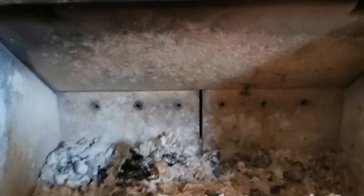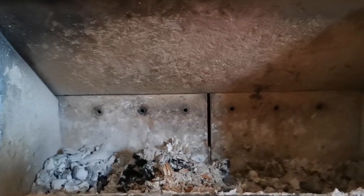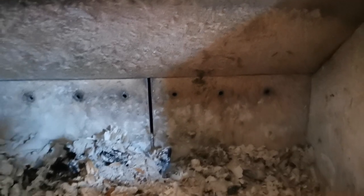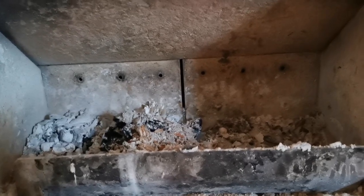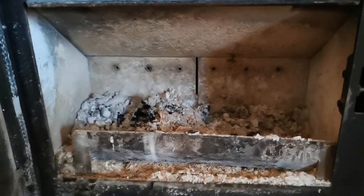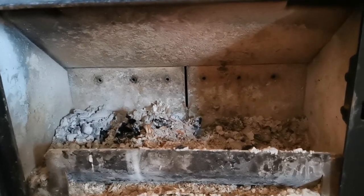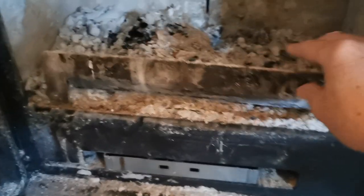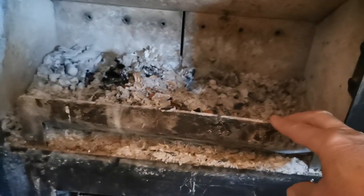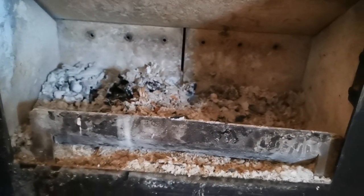The other thing to show you, which I didn't appreciate when we were buying this, but just look at the slope on the fire bricks at the top. This really does slope down quite aggressively, so there is a much reduced height at the rear of the firebox than there is at the front. We have found that that physically does interfere, particularly once you've burnt this fire for about 2 or 3 days. With the buildup of ash, the volume of the firebox is reduced significantly by that deep slant with the fire bricks. Also, with the retaining bar in the front here, which is advised to use when you're burning wood, again, there is a narrowing of the gap between the top and the bottom effectively.